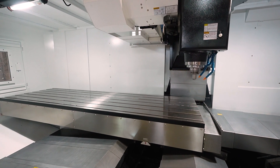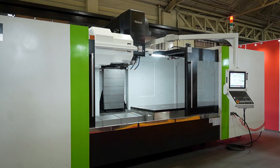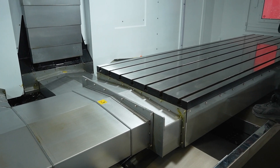When you have a machine of this size, it's really important to know that you've got a good machine foundation — a good rigid machine to cut big components on. What is important about the construction of the Hartford machine? It's incredibly heavy and it's got a lot of additional ribbing within the casting. We've got four support shears under the main table, so when we go to the extremities of the stroke, we get no sag whatsoever, even with maximum loading on the table — which in this case is just over four tonnes.